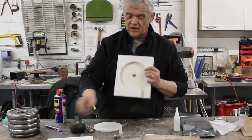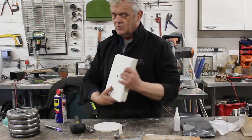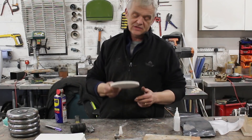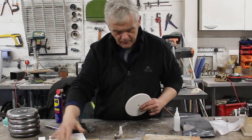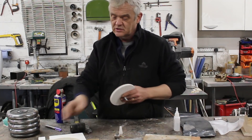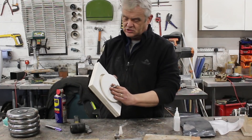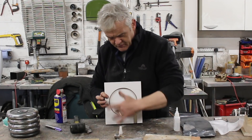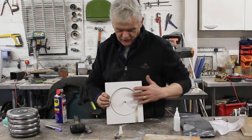That's everything glued together and I've cut an outlet right there. This plate will go on there to make our motor casing. The motor rotor is this plastic disc. When we run this, a spray of water hits the plastic disc and spins it — in the same way a Tesla turbine works. The rotor spins, and water exits through the outlet.